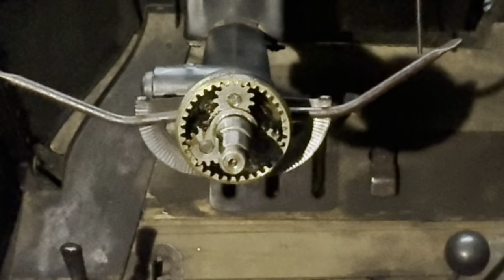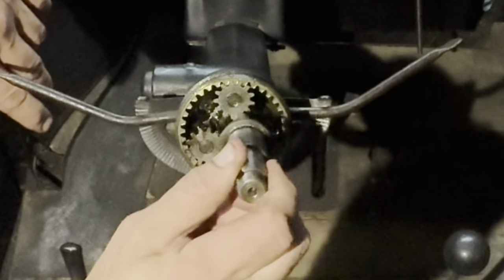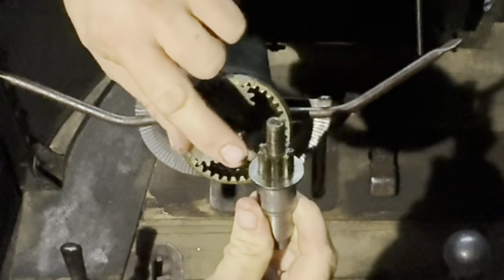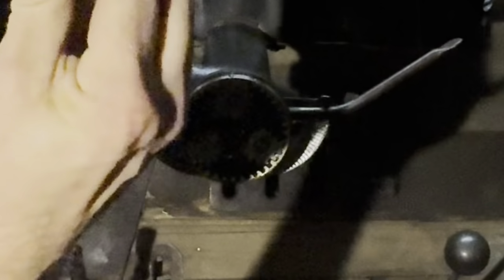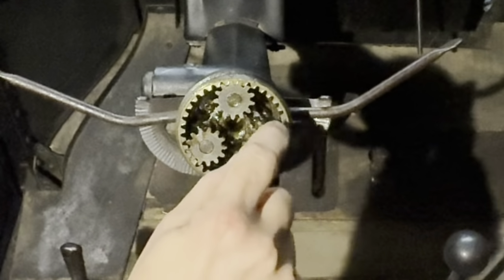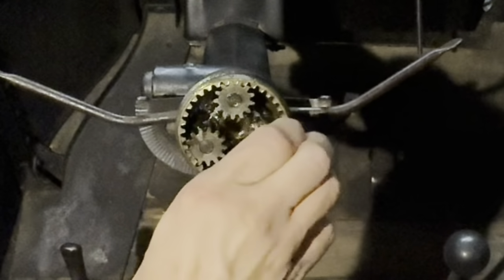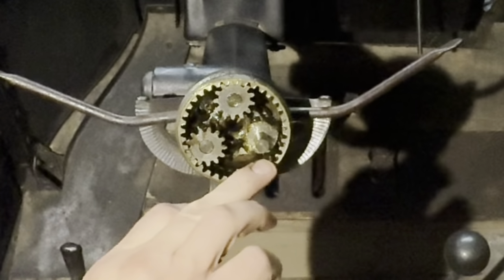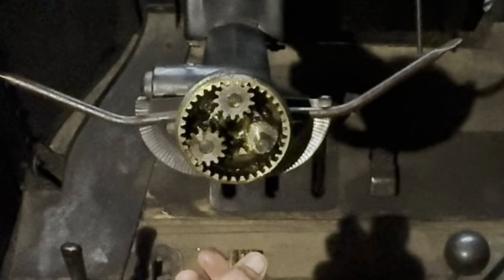And inside there, you've got the steering shaft adapter, I guess, that comes out. So there you've got 9 gears. That comes off. It's incidental, but these planetaries have 13 on there. Doesn't really matter because the ring gear has 36. So this one is 9, this one's 36, so you've got a 4-to-1 ratio there.